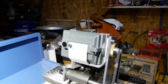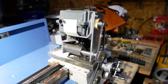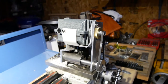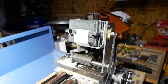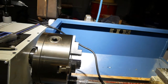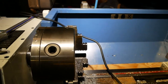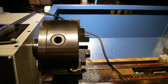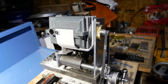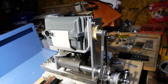In this video I want to show off something else. With just a tool post grinder there's not a lot you can do without being able to fix the angle of rotation that the chuck makes. Right now it's spinning free. That's fine for spinning stuff at relatively high speed, but with something like this you need to be able to set a specific location on something that's cylindrical, lock it there, and then cut the part.